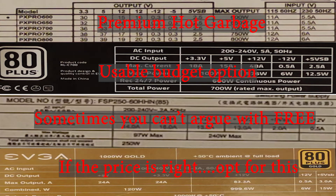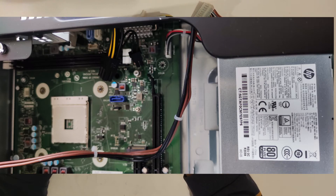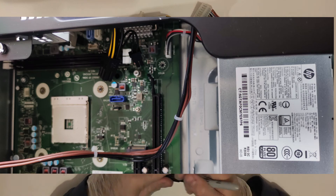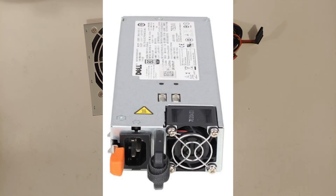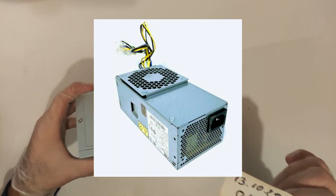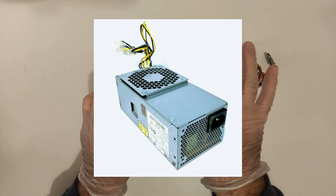The bottom line is that in most cases the price is the most off-putting thing. The only other edge case I can think of is if you find a good deal on an HP, Dell, Lenovo, or any other PSU from a large system integrator that seems to have excellent specs and a great price. It is my experience that most PSUs like this will have some sort of customization that makes them completely unusable in a normal PC — in the worst case with different pinouts on the various connectors, and in the best case the overall size and shape and fixing points are deliberately changed, making it very difficult to install in anything other than its designated case. Unless you know you need that exact PSU model for the pre-built you already own, I suggest not taking the risk and looking for a more suitable power supply.